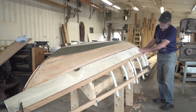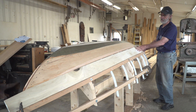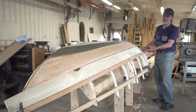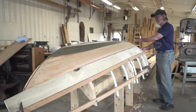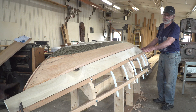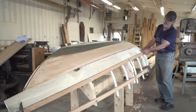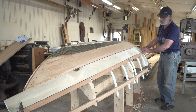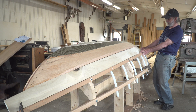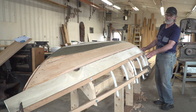Right now I'm making the first pattern of one of the binder strakes — that's the next strake up from the broad strake. I'm doing it with the same piece of plywood I used to make all the patterns for everything else on the whole boat. I cut it into shape a little bit haphazardly, then put it up against the boat and spiled off of it — about five-eighths of an inch, the thickness of my rule — then cut it. I've cut it a couple of times already and I've got it in position, then I decided to plane it a little tiny bit just to fit it.